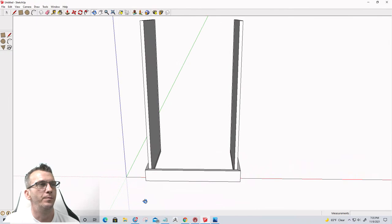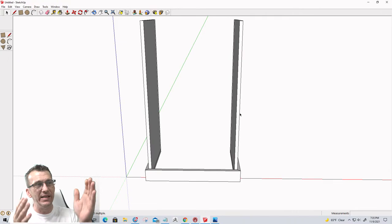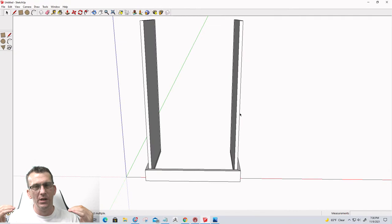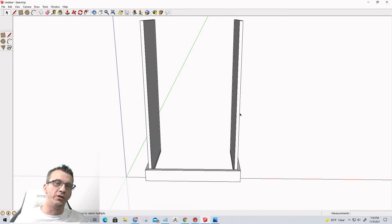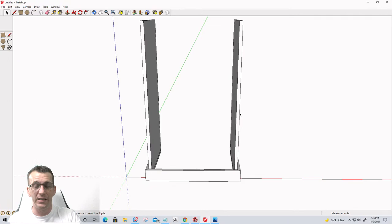Now, the sides, they're going to be carved on my CNC. My CNC can accommodate the sides for a couple of reasons. It's going to be a two-sided job, and I am going to probably utilize, I don't know if I'm going to go old school with this and have just wooden slides for the drawers, or if I'm going to go kind of new school and use mechanical slides, metal mechanical slides. It really depends, because what I do want, I know that I want, is a full pull. And if I use wooden slides, then there's going to be a point where if I pull, the drawer is just going to pull out unless I have a little stop in there or something for it. But I would like to be able to do full pull where it goes past the front, and be able to just get access to this drawer.